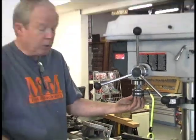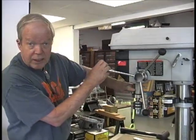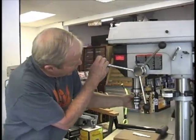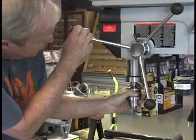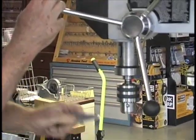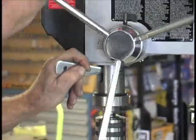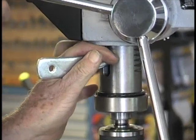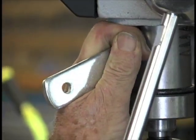When you want to remove the chuck, all you have to do is bring the chuck down. If you notice there's a slot on the side — if you turn the whole spindle, it comes around where there's an opening where you can see the key, and that will fit into the opening. Then just tap on it and the chuck will drop out.